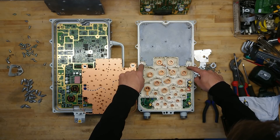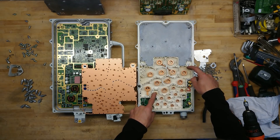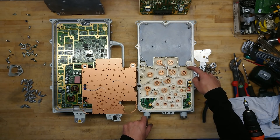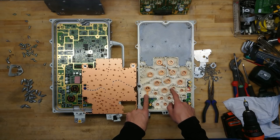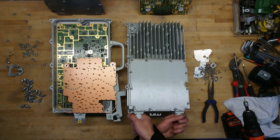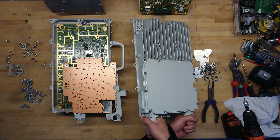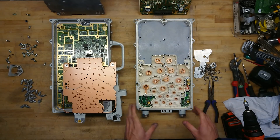The two transmit connectors from the power amplifier feed into these two ports and the signal goes down into the plate. The transmit path runs through the large resonators and connects down to the antenna connector. There is also a receiving part which goes over here to the antenna connector, with small resonators. Interestingly, there were also screws on the back side, so this is actually a double-sided duplexer — two sides to it. That's also something new I have not seen a design made like that before.